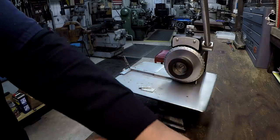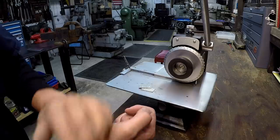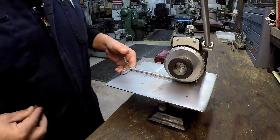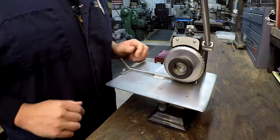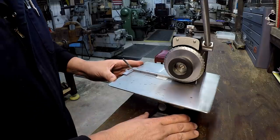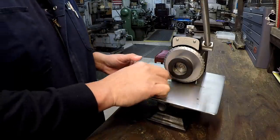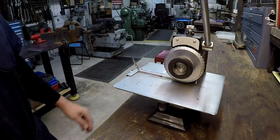So you can set the depth with this knob on the top on how far that you impress the metal there. There's also a little clamp, this little paddle right here. You push this back so that whenever you put your tag in there, you put it up inside there and then let go, and then it holds it for you so that it's not moving around. And you just line it up where you need to go, and then you start stamping it. Alrighty. And this is like an adjustable fence there too, so you can loosen this guy up and slide it up and down where it needs to go.